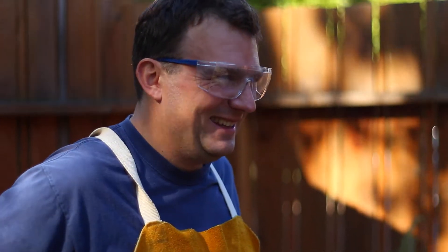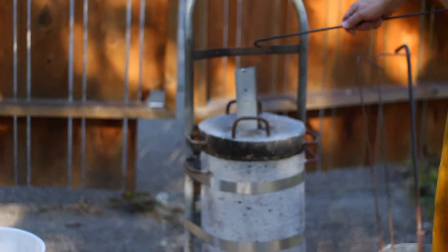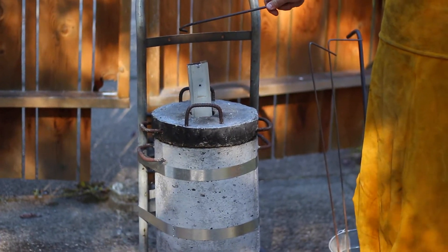They have been heated to about 500. Actually, melting down — this is your source of aluminum that you're melting down? Yeah, this is a screen door that I found on the side of the road. That is becoming aluminum. Yeah, aluminum that was made for extrusions, like for screen doors, is not ideal, because it was designed to be extruded, not designed to be cast, but it is super cheap.